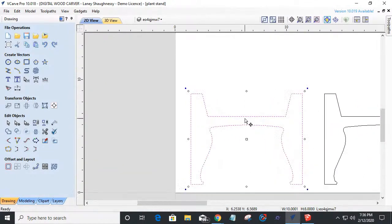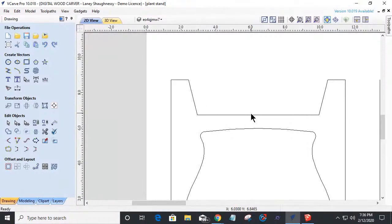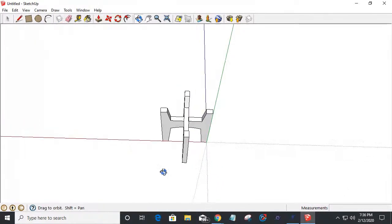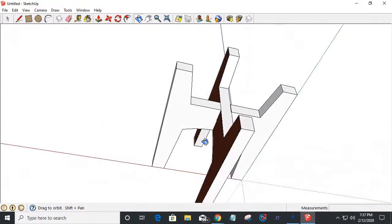And now we need to create the notches where they're going to join. One notch is going to be created from the top down here, and the other notch is going to be created from the bottom up, so that when those two parts fit together, they will kind of lock together to create that kind of a cross pattern. If I come in here and delete my circles, to create that cross pattern there, we're going to notch things together.